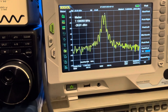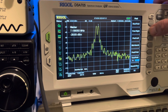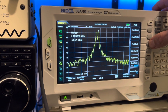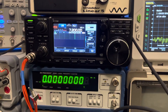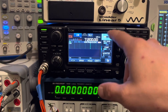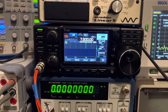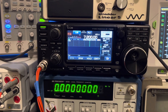We're just a little bit over where we want to be on the peak — about 40 dB, so just barely making that Part 97 standard. It's still 3 dB off, but it's much closer to meeting it with lower output power. Maybe some people run it like that because they're running into an amplifier, but Part 97 says even an amplifier has to meet that same spurious emissions standard.